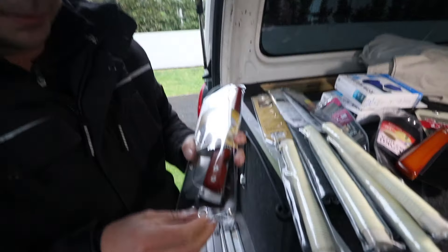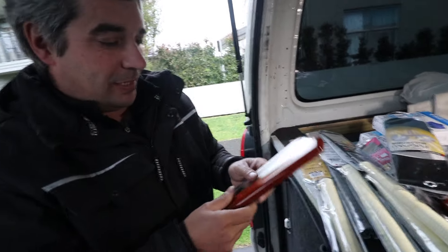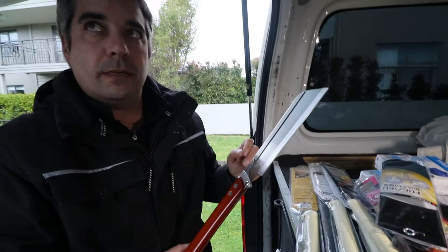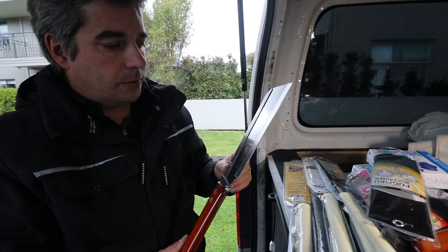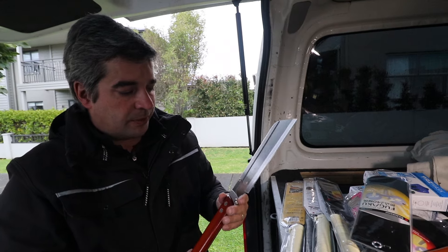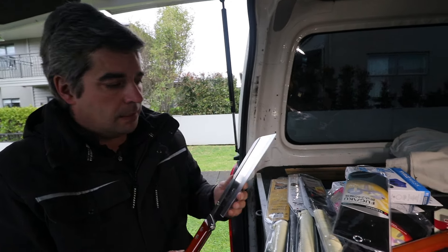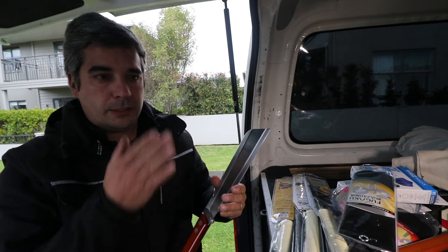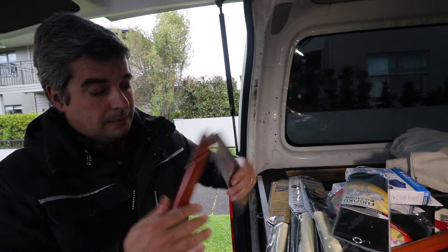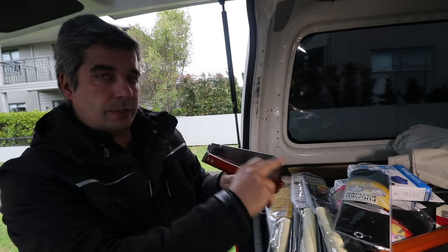That's one option. This one here is probably one of my favorites — that's why we have only one left. Pretty popular. This saw is a combination of both cross cut and ripping in one saw, but on the same edge. It's great for furniture making, cutting dovetails, but also for trimming like skirting boards — anything that actually requires accurate cuts.